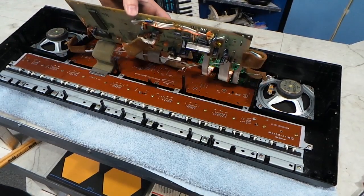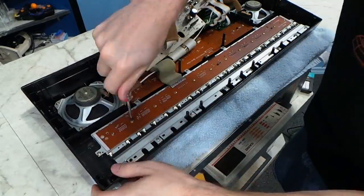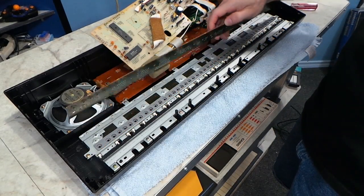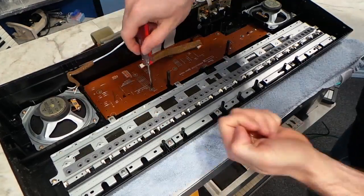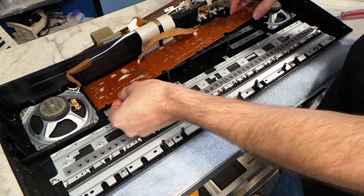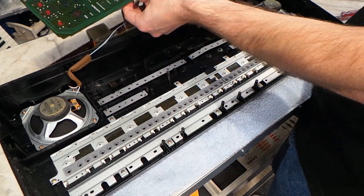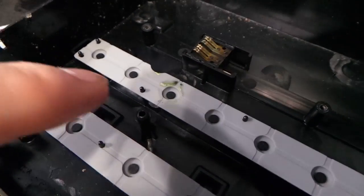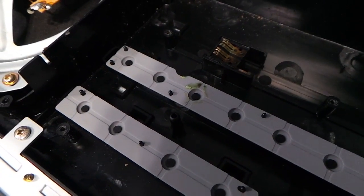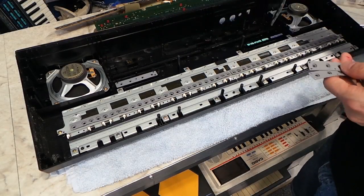So I can finally lift the logic board and, as I suspected, I'll have to remove all of these boards since they're all connected together. I'll start with this sensor board for the keys. And now to remove the board with all of the buttons on it — I'm curious to get a look at this board so I can see why those buttons are not functioning. Well, you can see there is some sort of residue on this button, and this is the button for the bells instrument that I mentioned was not working. I cannot see why this would stop it from working, but it does look suspicious. So I'll go ahead and take all these pads off.